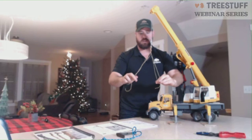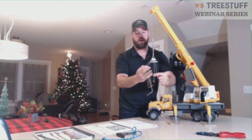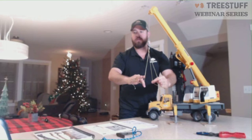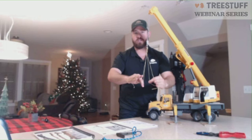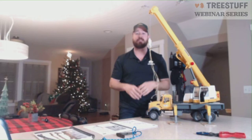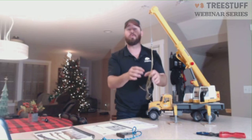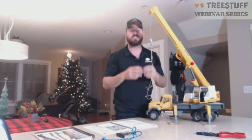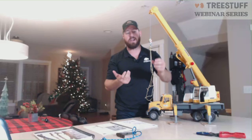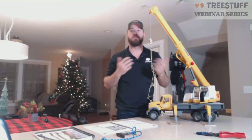So when you have these 4 slings on here, you're only ever holding all the weight on 3 of them. No matter how balanced this piece is, only 3 slings are catching the full brunt of the load. So even if you have 4 slings and each sling's rated for, say, 2,000 pounds, your total configuration is not good for 8,000. It's only good for 6,000, because your capacity is only good for the same weight of 3 legs. The 4th leg of a bridle is purely there to give stability and to limit movement.